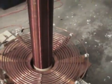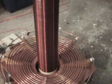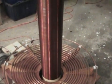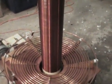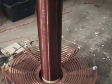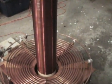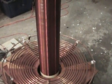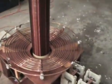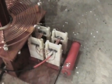What I ended up doing — I had another secondary handy, which was my old secondary. The one you saw here before was wound with number 22 gauge wire. This other secondary is the same except it's wound with number 24 gauge wire, so it has a lower resonant frequency. With that secondary, I just about work out the same on my tuning with this added capacitor.